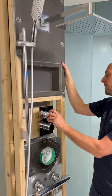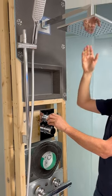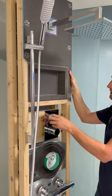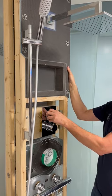Generally there's no issues with the diverter. Very rarely you might get a tiny bit of passing water which happens sporadically. This can be rectified by taking out the cartridge and cleaning it, checking your seals, or worst case replacing it with a new one.